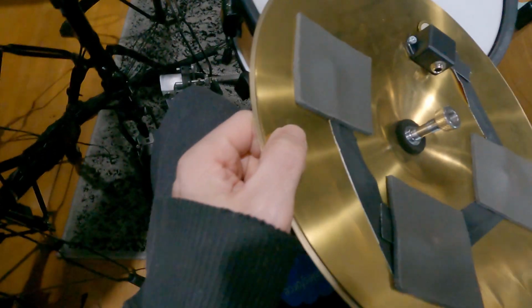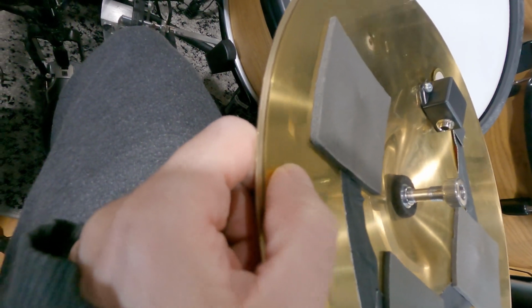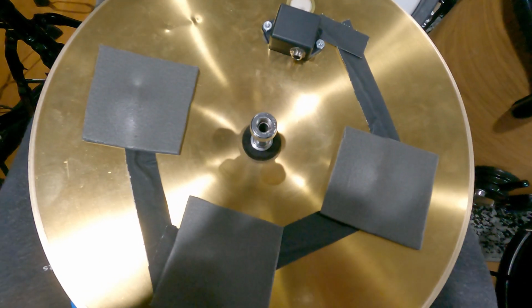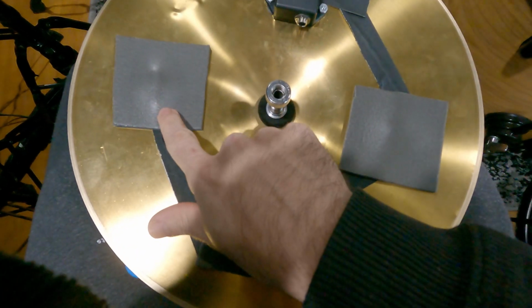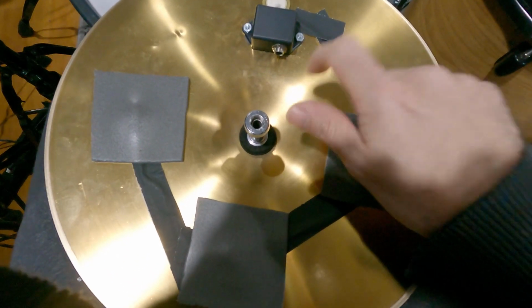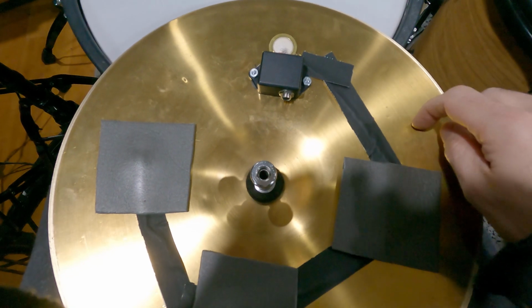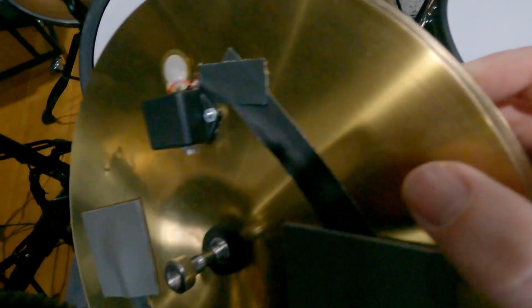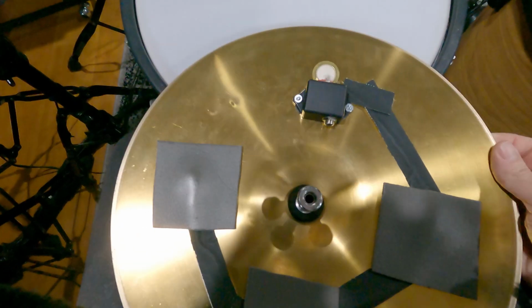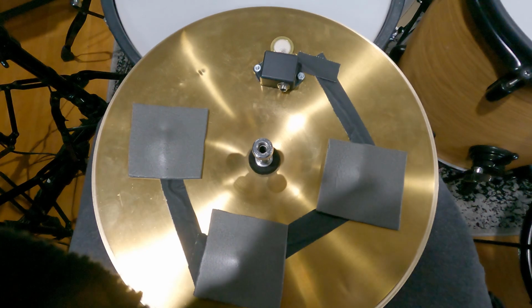So that's what's happening: if you look here, there's a slight gap. When I squeeze it, that is what's making my trigger. So when I hit the top of this hat, it is actually striking the bottom hat as well and making a switch. You're going to need 1, 2, 3, 4 piezos wired in series. You also need to get some kind of dampening material to put in between the two hi-hats so that they're not touching. Again, you don't want them touching all the time. You want that gap there. If you don't have that, it's not going to work. So that's it in a nutshell. Let's move on to my workbench, and I'll walk you through this whole process.